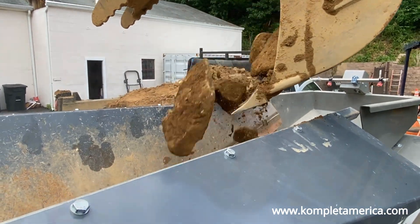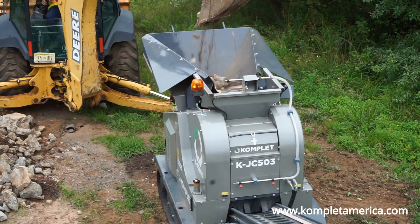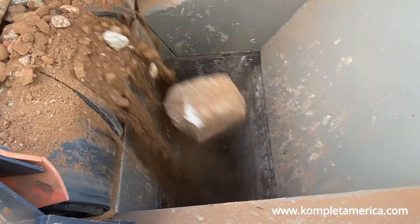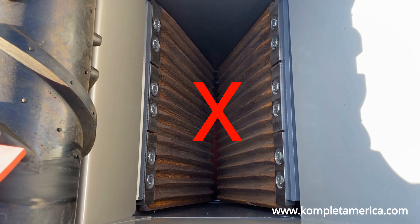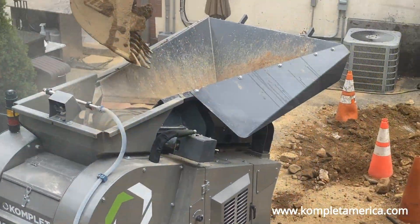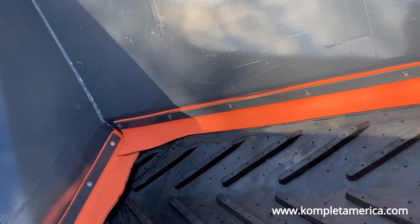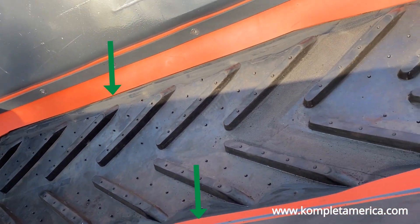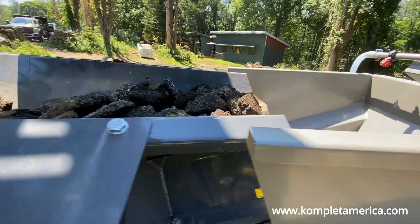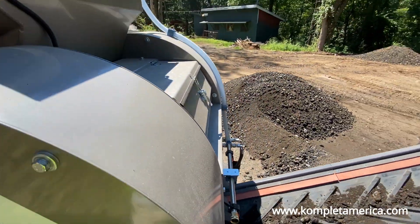We recommend using a mini excavator to load the KJC 503, but you may also use a skid steer or backhoe as well. Load as clean of a material as possible with minimal dirt to avoid filling up the hopper and jaw chamber and reducing your production output. Never drop material directly into the jaw chamber. Also, be sure to not drop material from a very high distance to avoid ripping your loading belt rubber sills that run along each side of the belt and prevent material from getting underneath and causing damage. We recommend you only fill the hopper halfway or three quarters of the way depending on the type of material you are crushing to avoid overloading the belt and causing it to slip.